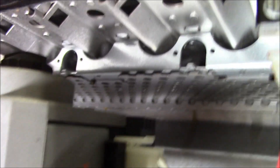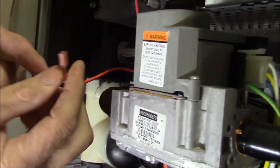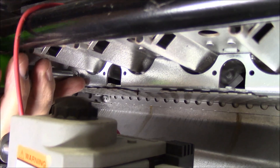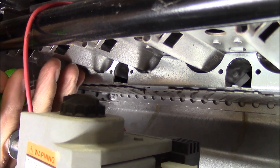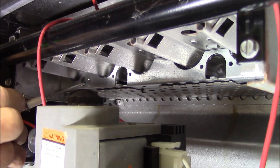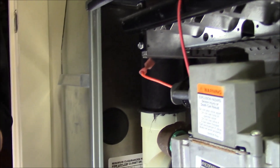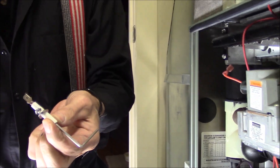So you're not sanding it to death, you're just trying to get the carbon off. Once you have the carbon off, it's working again. Turn the furnace power switch off. These are all where the flames come out, and over here at the far end you see this single red wire on a single spade — that's just a quarter-inch spade. And then sure enough, there it is. When we go to change these, it's almost always a quarter-inch set screw in here. Pop out this little sheet metal screw — try not to drop it in the guts of the furnace. This flame sensor in this furnace is angled. It's that easy. Since it's all cleaned up, you can sand it and put it back in.